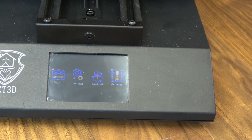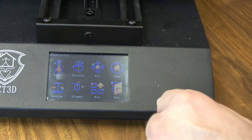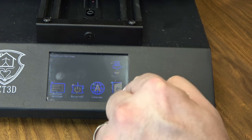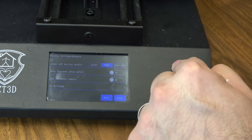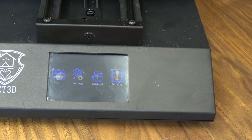Onto the touchscreen — it's a pretty common layout, actually a little bit of the older layout. You're starting to see more of the unified layouts like on the BigTreeTech screens, and this one doesn't have near as many features. A lot of it's there: preheat, filament load, fan settings, some advanced settings. They do have power-off resume, you can continue the print, disable steppers, and auto shutoff after the print's complete. Nothing wrong with it at all, but pretty typical for a touchscreen layout.